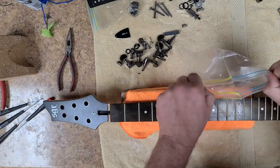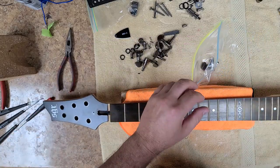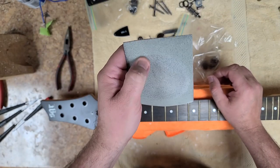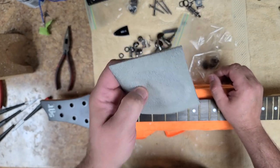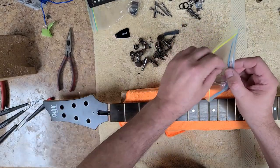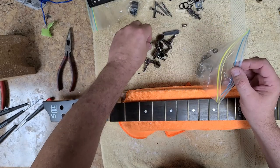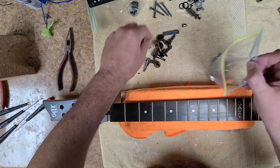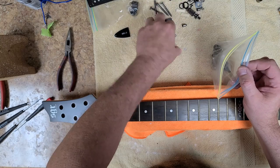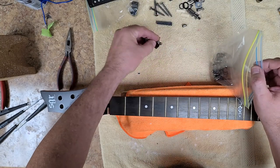And paper towel has got kind of the consistency, now, this is a 3,000 grit sandpaper, it's got the consistency of about a 3,000 or 4,000 grit sandpaper. So it does have a little bit of grit to it. It does have a little bit of potential to scratch a finish. I've been using microfiber, and it doesn't have to be expensive microfiber. I get a bundle, they're like 12 per pack, and I think it's only a few bucks.